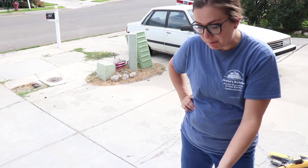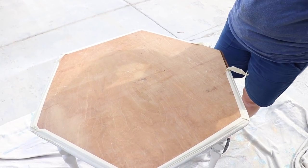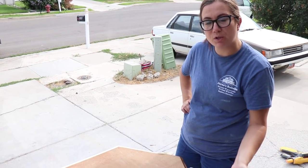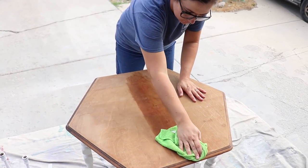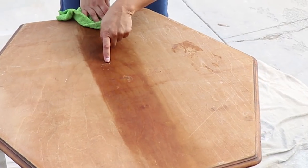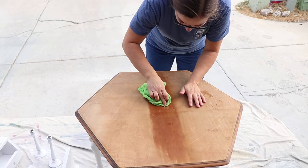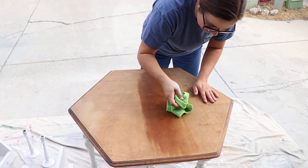I'm going to remove this masking tape and then take a damp cloth and wipe down the top. That'll remove most of the overspray because it's still not been sealed, so it's water soluble. If I need to, I might hand sand off a few spots I can't get off. Some of this paint is not from us — that will have to come off. You could use a magic eraser, but I'll probably just sand it. These parts that are just overspray are pretty well coming off with this damp rag.